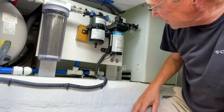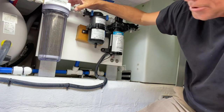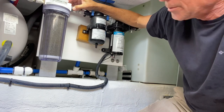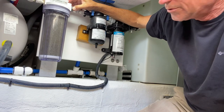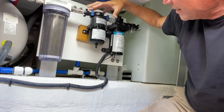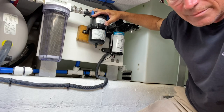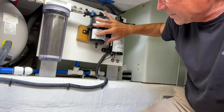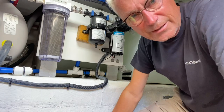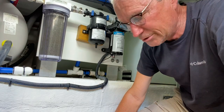The next thing you're going to want to do is push this red button at the top of the water filter. What that does is release air pressure in the system and in the filter — it makes the filter much easier to get off. I have an accumulator tank here; many boats don't. It simply adds additional pressure into the water line so that you don't get that hammering sound.